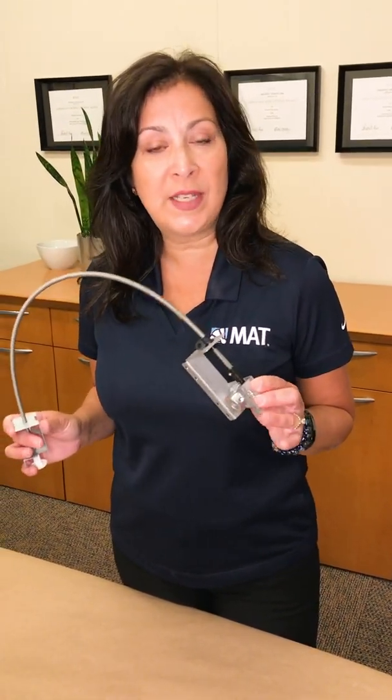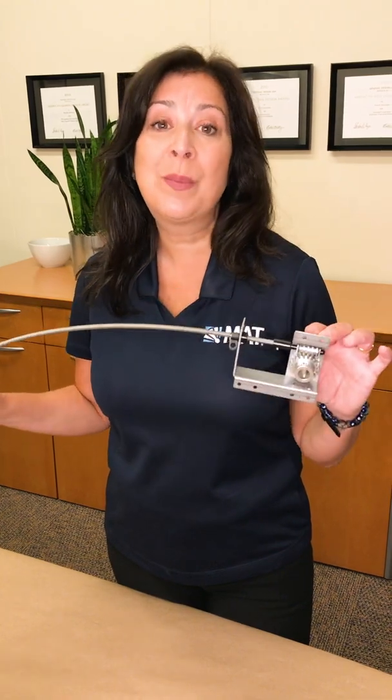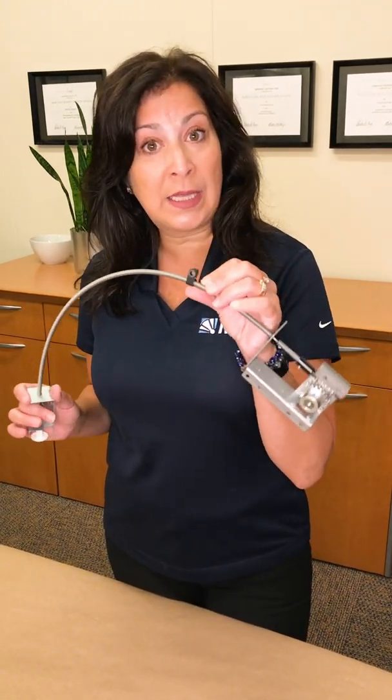For projects where you want to bring the cable outside the trim and go into a hard ceiling, you want to use our Worm Gear Actuator. Our Worm Gear Actuator cable and termination point will ship completely assembled to the job site — no pieces to lose, no assembly required. This option allows you to run up to 100 feet of cable. We may not see 100 feet, but there are cases where we see 25 to 30 feet of cable. We recommend the cable be secured every 3 feet with nylon clamps that we provide.